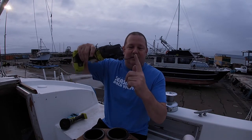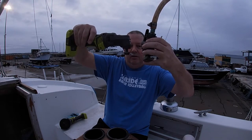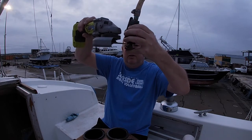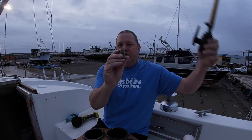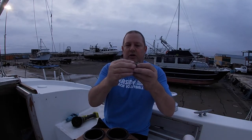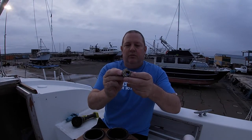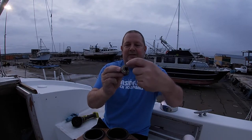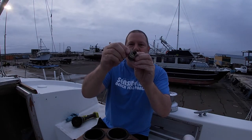I've seen some people do it the wrong way. You can take a little cutter like this. If it's plastic, cut it off — and you want to cut it off in between this nut right here and the through-hole fitting. If this through-hole fitting is plastic or bronze, you're going to want to get an angle grinder and cut it off. Once you cut this through-hole fitting so the valve is off, you're going to have a nut on your through-hole fitting. What you want to do next is cut here like I did, down onto it, so you're cutting and busting this nut off.